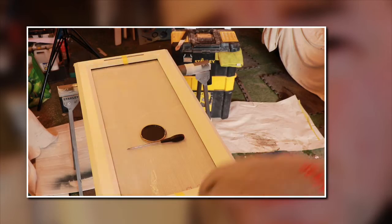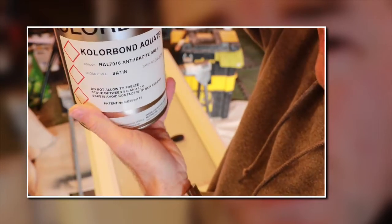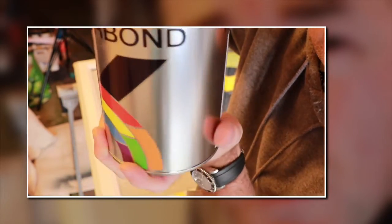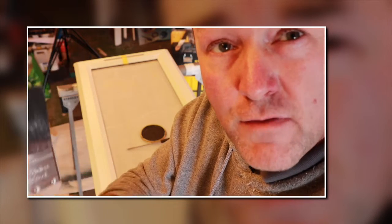Back with you - had some technical issues with the battery but not to worry. Back to the paint - I've mixed it up. I'm going to work from the opposite side of the tin that hasn't got the label telling me what the actual product is. When you're brushing this Colourbond Brushable, you need to put your first coat as a medium thickness of coat. Don't over-brush it - you've got to put it on, get a nice coverage best you can, but don't over-brush it and don't over-apply, don't try and scrub it out.